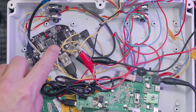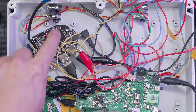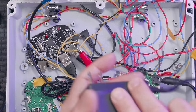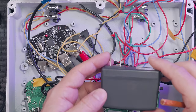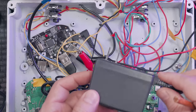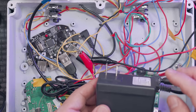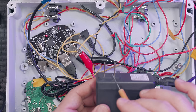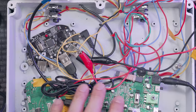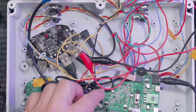And then I have a USB hub here. Now this is my second issue that I'm having, because this is not a grounded USB hub. So it's powered, but it's powered with only the two prong. So I have it going out over here and then plugging it in. It's powering both my Walkmans, and I think this is a pretty terrible idea, getting a lot of line noise. So what I want to try to do is two things in V3: get a three-prong grounded USB hub, or run both these off batteries, which would be the cleanest, quietest method of powering these circuit boards.